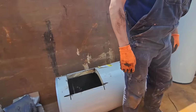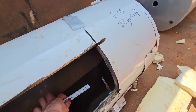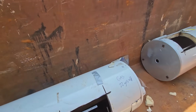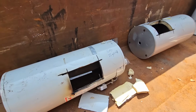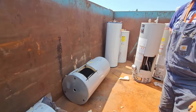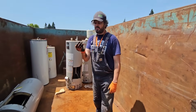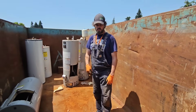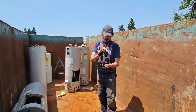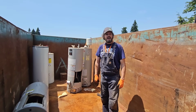So if people have this Bradford White, and they have white stuff coming in when they get something to drink, it's that thing? Yeah, it could be. If your aerator's at your sinks, when you open up the aerator, you should be clearing out the aerators of your sinks no matter what source you are. That's why they put them on there. You can take your little aerator off of every sink faucet and clean that little filter screen in there. That's a new video, because I don't think anyone else had to do that.